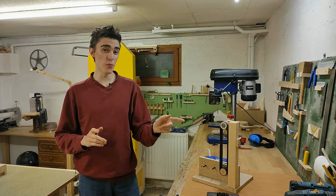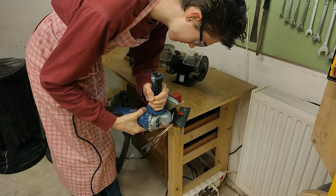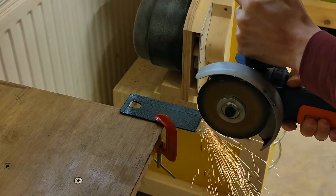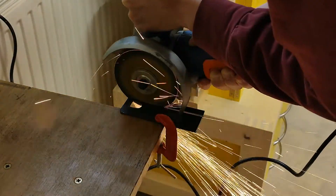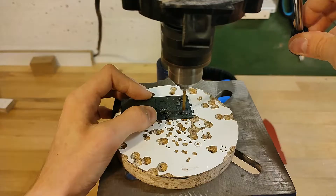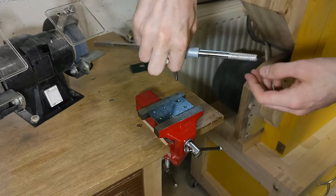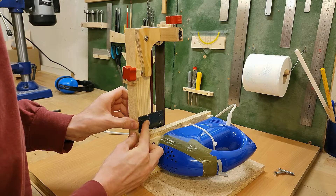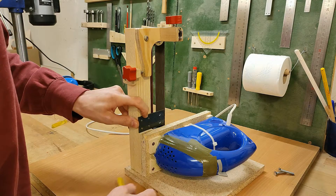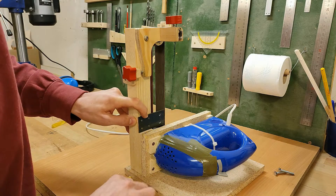And with that out of the way we can turn our attention to the skid plate. To begin with I'm going to cut up this powder coated piece of an old foot pump, basically just to get some flat 2.5mm steel bar - the powder coating is of no importance. Then drilling holes and tapping some of them. This also just screws to the vertical beam - I just put it there, flush with this surface here, mark the positioning of these holes, and just screw it down.